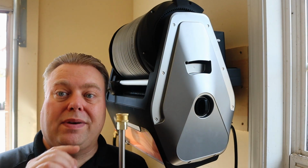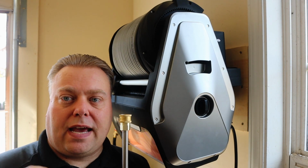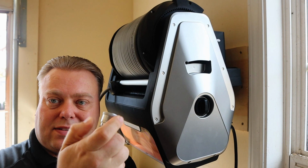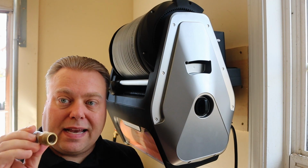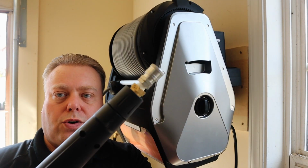Now I'm gonna show you a few things to make this stock setup even better for just a few dollars in adapters. This is an M22 14mm to 1/4-inch quick disconnect. This allows you to take that longer wand and shorten it up. There is a 1-piece unit that does the exact same thing. I'll leave a link in the description below. And now we have a much shorter wand.